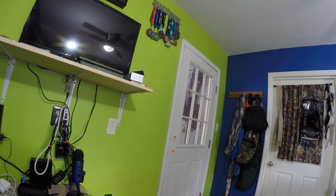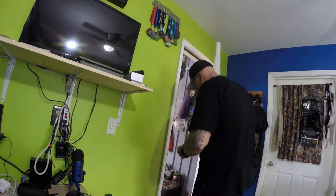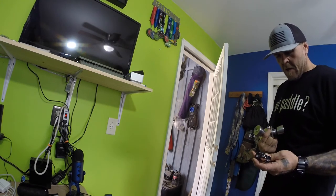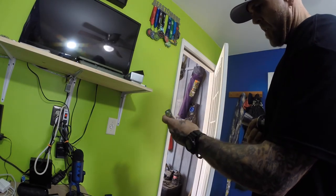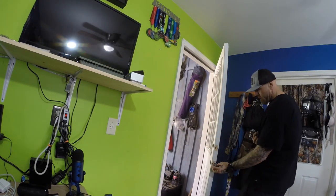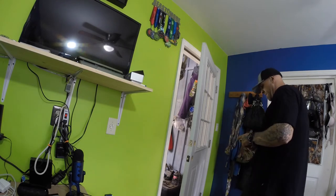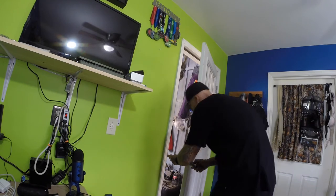This is the actual key lock that was on the other door. I'll just put this on here just for the video, just in case nobody's ever done it. It's pretty easy. These have different depth settings. When you stick it in, you'll know if it's the right one. Square part goes to the back. And this is actually the right setting for the door. Key part to the outside, obviously. Push it through.